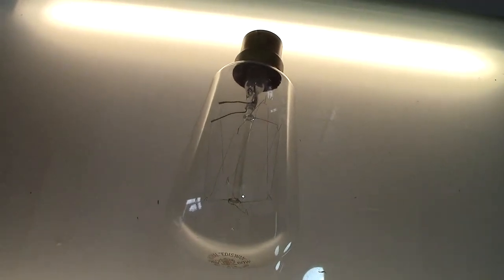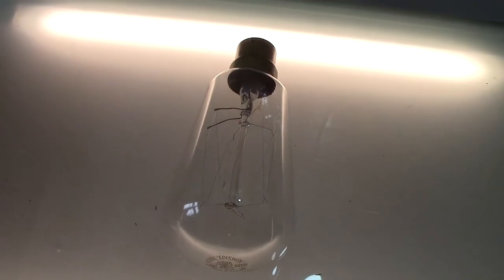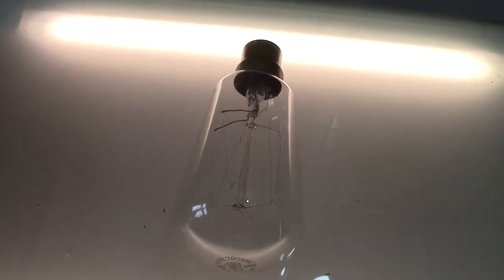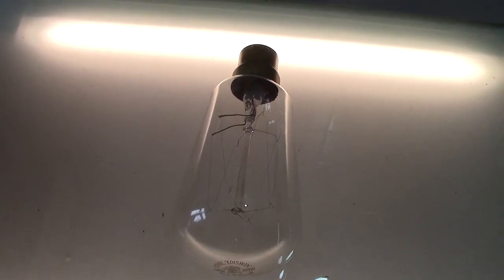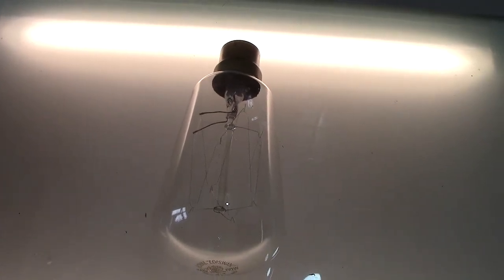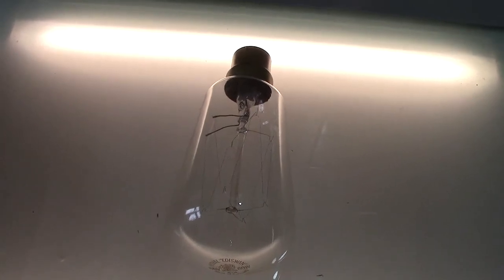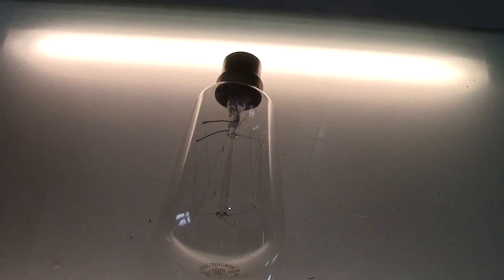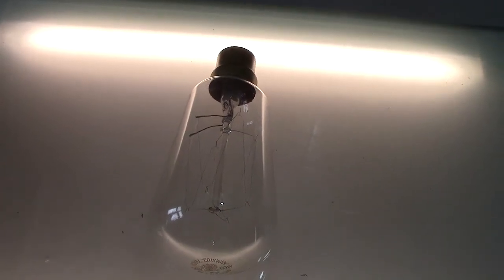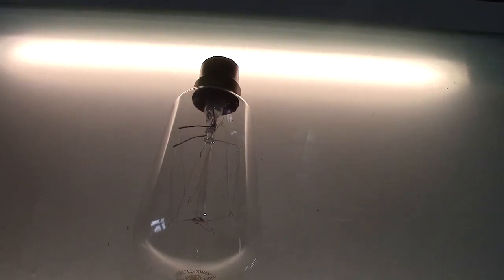Now, blue referred to the fact that if the power went down or there was a problem with the batteries, we had enormous batteries which powered up to 50 volts. That had been 25 large cells of the acid batteries or accumulators, sulfuric acid, and had the two plates, Faure plate and a Planté plate. They're the two types of plates which were immersed into the acid, and each cell was 2.2 volts, or under load 2 volts. Anyhow, if there was a fault, you'd get a green lamp up.